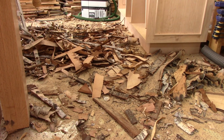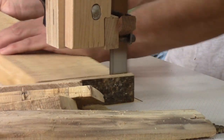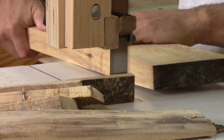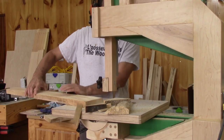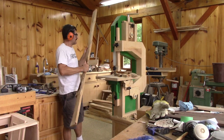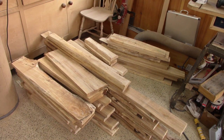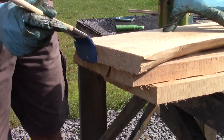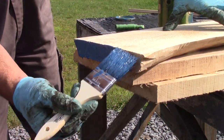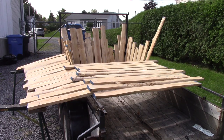But my shop looks more like a dump than anything else. But this can be easily fixed. Now I have a nice pile of boards. But before piling them for drying, I make a fresh cut on all their ends. I'm ready. This is a nice pile of wood, but I need to protect all the ends. So I brush a coat of old paint on every end of every board. When I'm done, the trailer is full of boards.